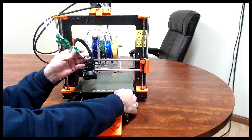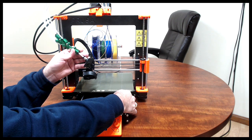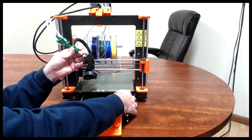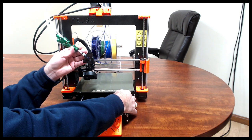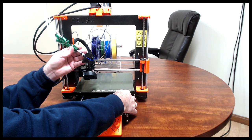And now I'm going to do the exact same thing again — a three and a half second pulse — one, two, three, four — and press the button again, and it will continue to move the filament. As long as I'm holding the button in, the filament will move forward. And there's our blue filament. Again, a five-second pulse will rewind it — one, two, three, four, five — and as long as I hold it, it will continue to unload.